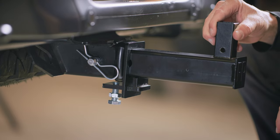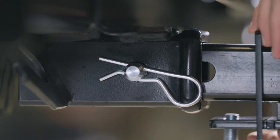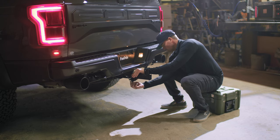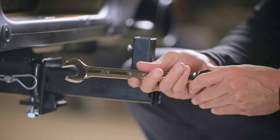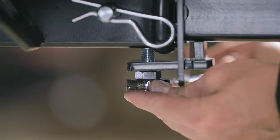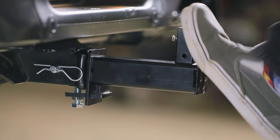As you can see, there's still wobble with the dummy hitch — don't worry, this is why we have the hitch tightener. Push the hitch tightener up against the back end of the receiver and then hand tighten the bolt underneath, like this. To tighten it even further, use a 3/4-inch socket on a ratchet or the flat wrench from the box. Once fully tightened, your hitch will have no give. Now you have the secured base for your fan pole.